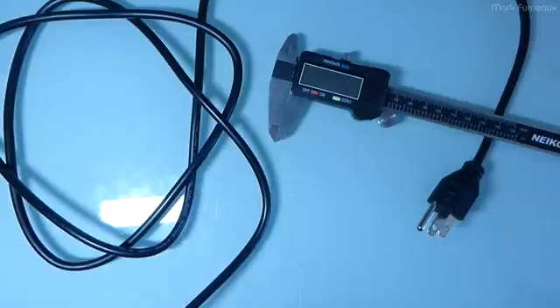We're in constant current mode at 10 amps — you can see the cable is starting to move as it softens up. You can see that solder joint is the weak point. The cable is starting to smoke, reaching 100 degrees. And that's it — cable's broken right at the end. We've peaked out around 120 degrees or so.